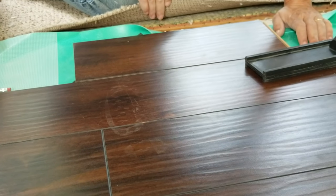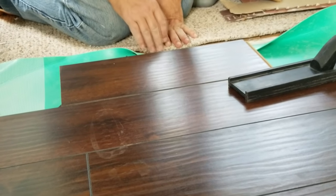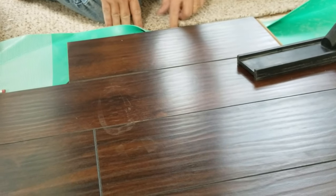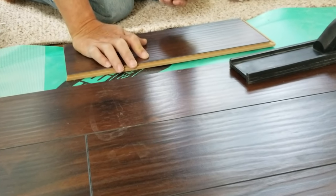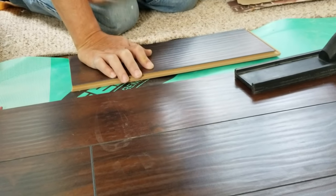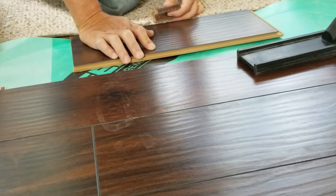There are no pieces out there that will single-handedly cover this type of transition. You can't use a standard carpet transition piece because the carpet is at or below floor level and those pieces don't give you enough dimension. The piece that will work best is a threshold piece — the kind normally used where wood floors meet a sliding glass door. The previous owner apparently had sliding glass doors and converted this into an enclosed patio.